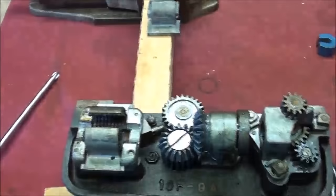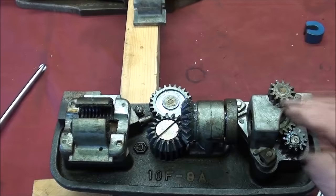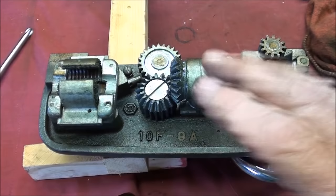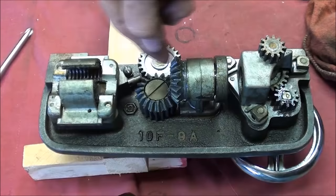When I put the lead screw through here, I will have to align that keyway with the key — so don't force anything if you've got one of these apart. I really don't have any cleaning to do here; there are no chips in there, which is very surprising. That means either that person was very careful or never used an air gun to clean his lathe, because otherwise chips will get up in here — in all of the gears, the lead screw, and the half nut. So that's how this entire system works.